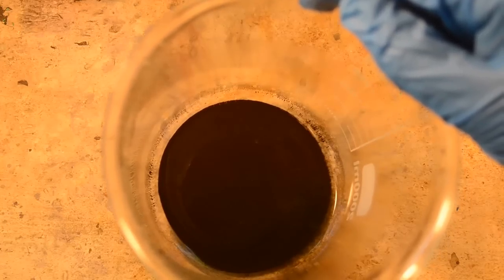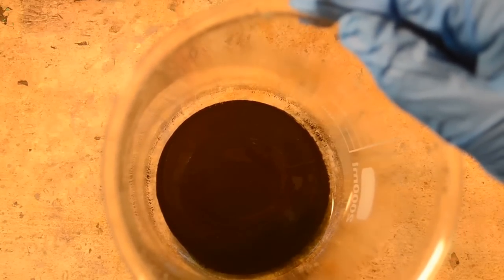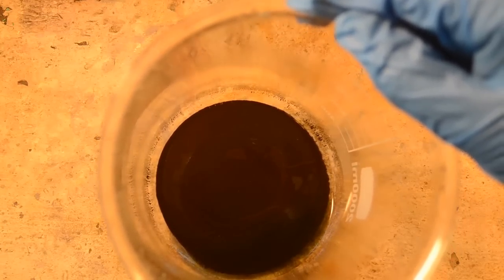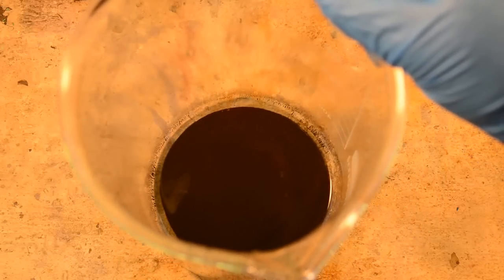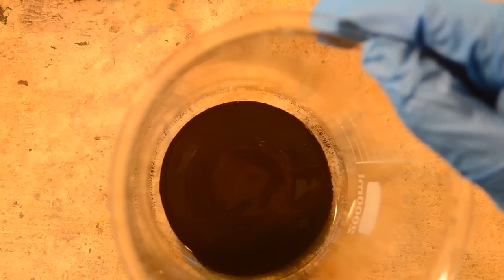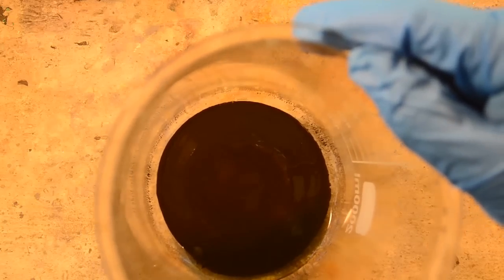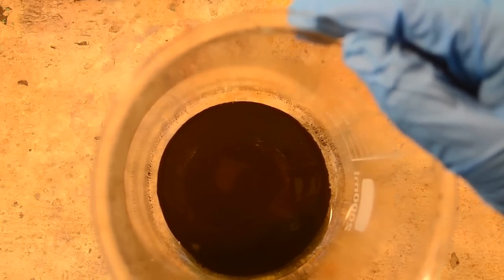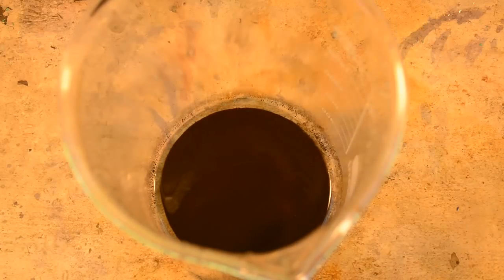What I might do is just re-dissolve this stuff in aqua regia and set it aside until I have a way of dealing with the rest of the material, then recombine it all together so I get a total weight on everything. This stuff is pretty fine and it's going to be hard to deal with. I'll re-dissolve it and brainstorm on ways to deal with the bulk of the material because I've got nineteen times this much stuff left to deal with.